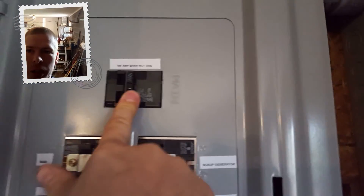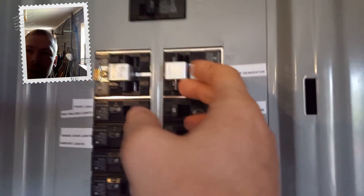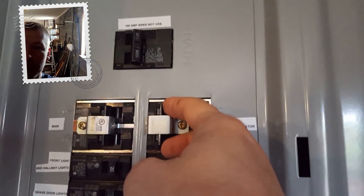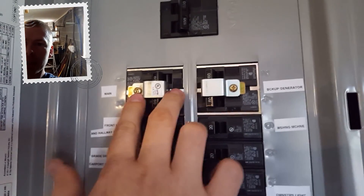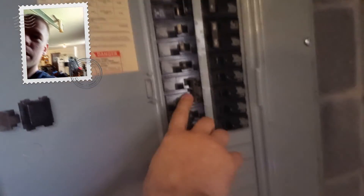The power goes over and up and all the way across the top. Here's our breaker panel — the power from the inverter goes right here. This switch controls it — if the switch is all the way to the right, we're powering from solar. If it's all the way to the left, that pushes this bar which pushes the main breaker off. I can never back-feed power because of this bar. Whenever I'm done with emergency backup, I switch it back over — it flips this breaker off and turns the other one on, which is powered by this breaker in this panel.